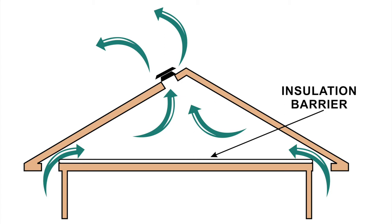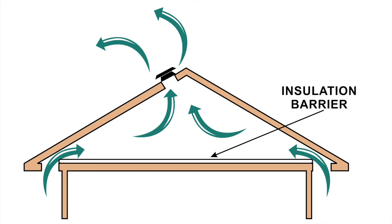You're meant to have a good insulation barrier on the upper ceiling in your home so that house heat is kept down and out. When house heat gets into the attic space and is not moved out properly, it gets stagnant against the ice-cold roofing members and causes condensation because it reaches dew point.